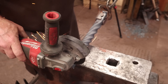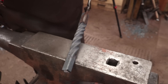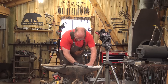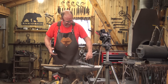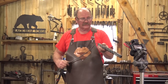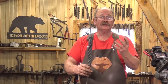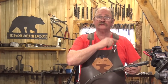These plugs are just temporary — it's definitely work to get the sand back out. Why bother going through all that trouble? Just like using the shorter solid bar, this is going to be a lot lighter with the sand out. But also, it is now hollow, and if you need to run electrical wiring through it — if the building inspector says it's okay — you now have a conduit. So if your stair rail is going to have a light at the end, or this is part of a floor lamp or another element that needs wiring, this works great. And that's a good reason to use tube in the first place.